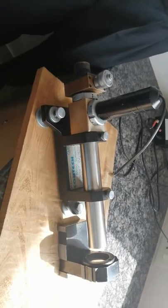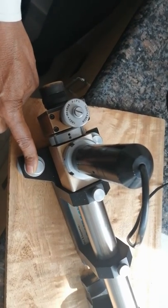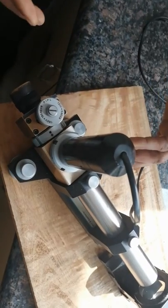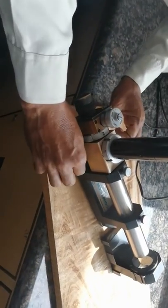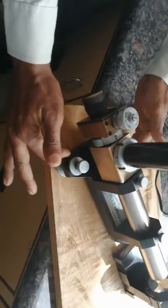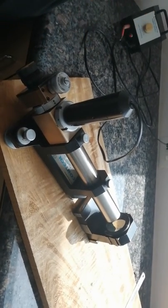Coincide the horizontal line of the yellow cross wire with the horizontal line of the black cross wire using the initial level adjuster. Rotate both adjusters in the same direction and same magnitude — this you have to remember. After coinciding, lock it using the lock nut. This completes the initial setting of the instrument.